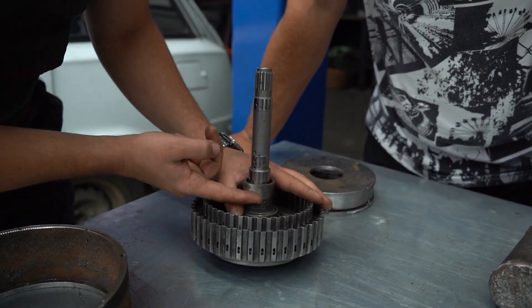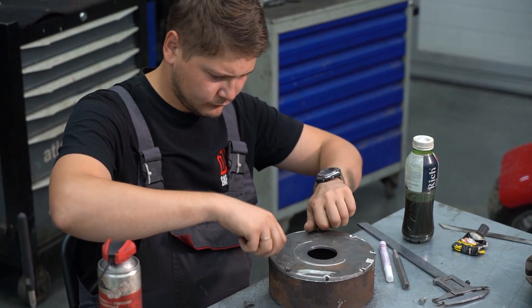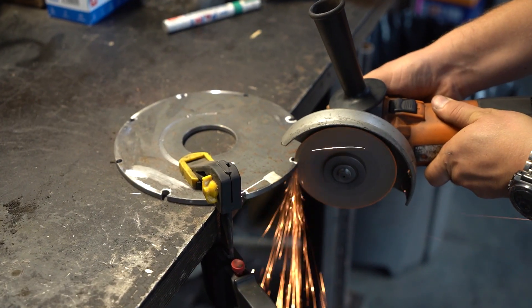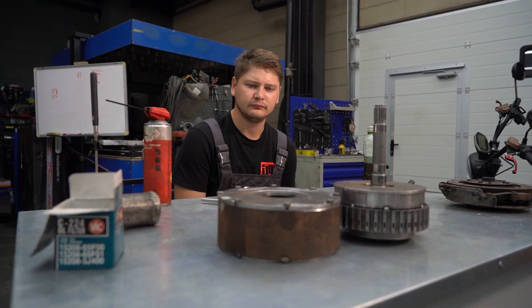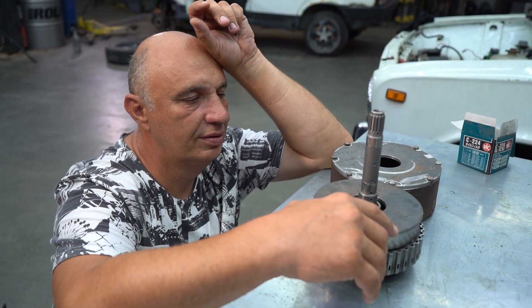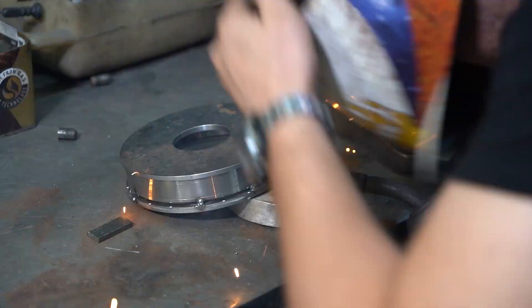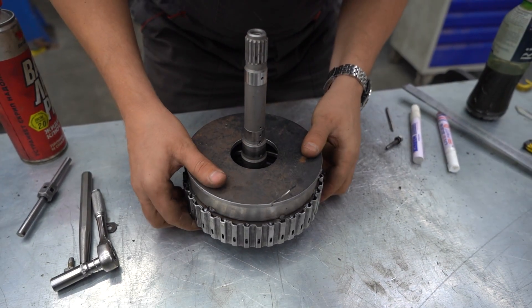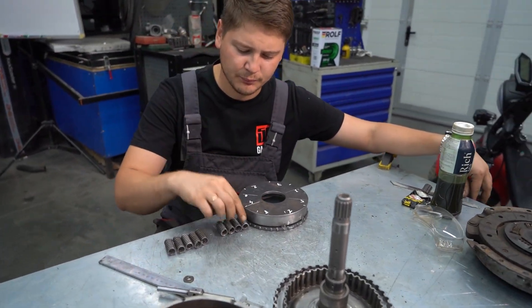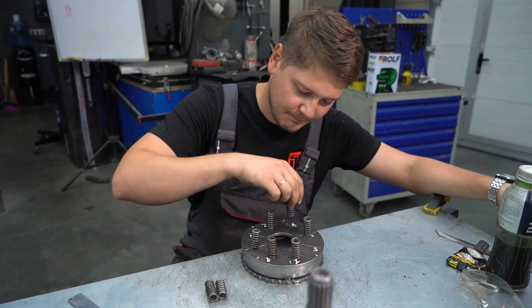This snout right here is half empty. We're going to make an incision and stick a pipe in. We're going to fit some springs — they should evenly distribute the pressure. Pull the centerpiece and it should move evenly, though it might bind. Here we have the inner drum; our lathe operator precisely divided it into eight sections, and here we're going to be running some guides. We'll use bolts or studs, placed at about half the height of the springs — four pairs placed across from each other.